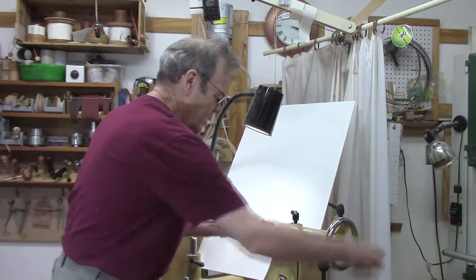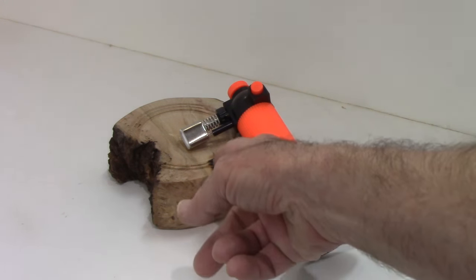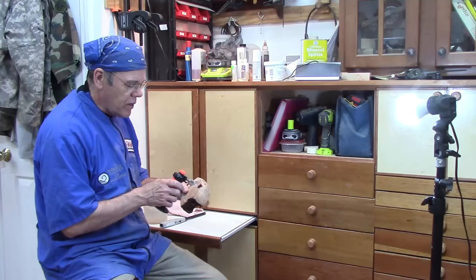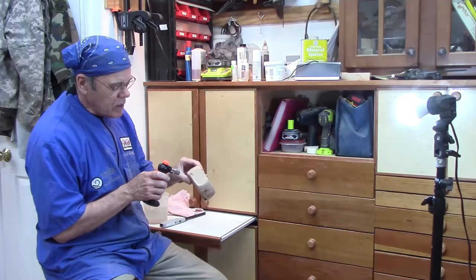First thing I want to start off with is a handy little trick. If you've got some odd piece with a little imperfection that you want to blend in and make look like a bark inclusion, you can just burn it with a small butane torch — similar to this orange one here. You can see where I burned this little area where I had a little chip fly out. These are not expensive and they use butane canisters to refuel, similar to a lighter. We're going to concentrate on burning this little area here and then come back and burn this little area at the bottom.